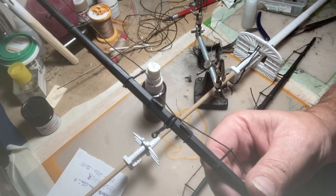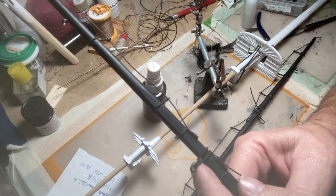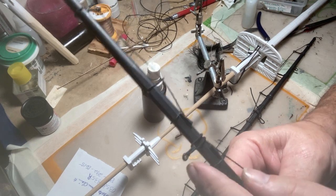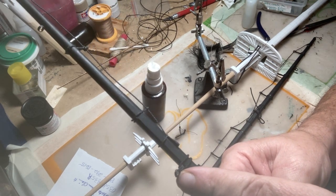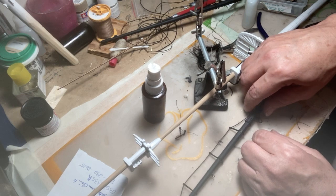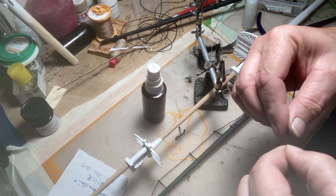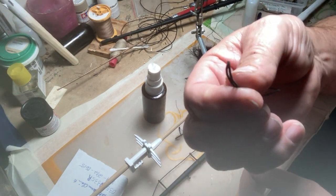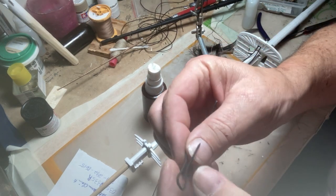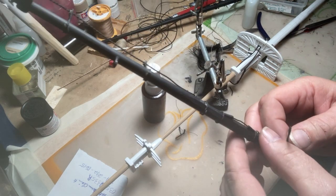slings. I'm gonna show how to make the second part of the sling. Part that goes on the yard, as you can see, right here, right? Again, it has a little bullseye, if you will, right there. And you take your stock that you're gonna use, a piece of served line, the appropriate thickness, and you double it over right about that long or so. All right, and make sure it's long enough.